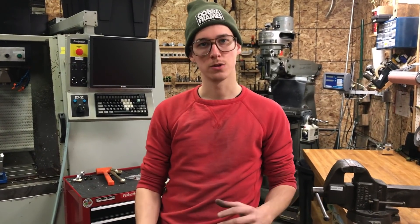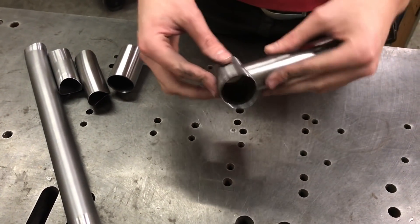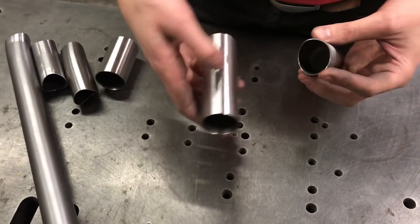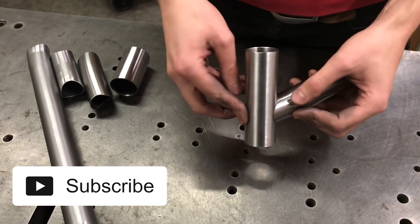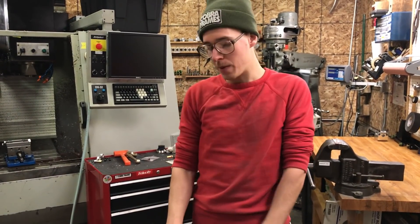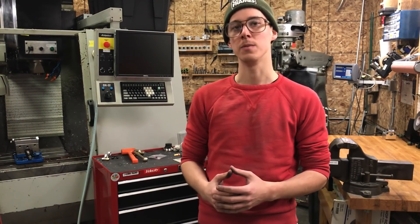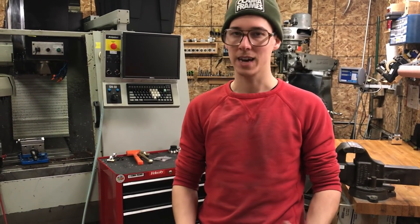I batch mitered all of those joints and now I have a collection here of different tubes that are ready for welding. I also deburred these and cleaned them on my belt sander — there will be a video about how I like to do that with all the steps involved. These fit together nicely. I got a bunch of them so I can sit down and do a couple, put the rest in the drawer, come back the next day, do a couple more. I get all the prep work done in a batch so I can work the practice in whenever I get a chance. That makes it easy to regularly practice and get a lot of growth every day or every couple of days.